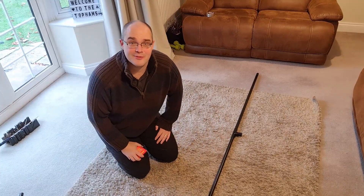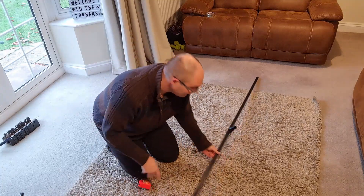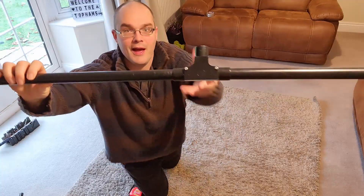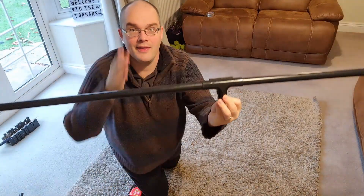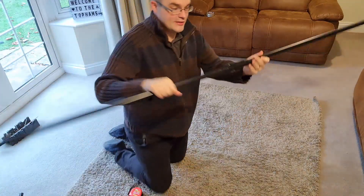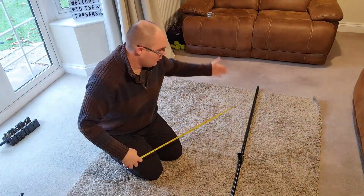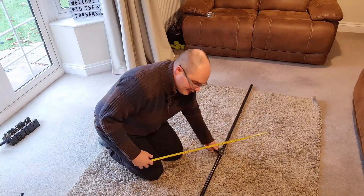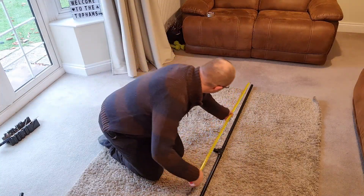If you're like me you don't have a workshop, so you make use of any room in the house — here I am in the living room. What I've done is cut the conduit in half and put a T-junction in the middle. My hope is that that will end up as a point of balance and then the elements and dipole can grow across the top. Now I have to very accurately mark out and measure where the reflector, the dipole, and each of the directors are going to be, so that I can start drilling some holes and cutting some things.